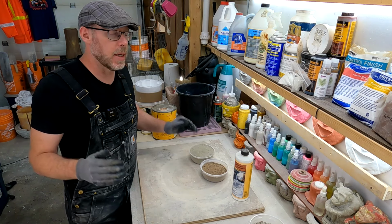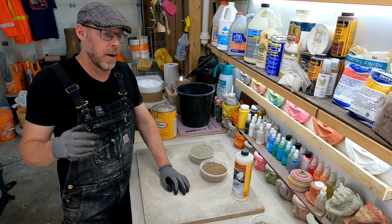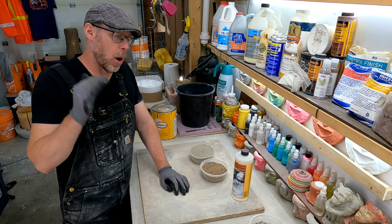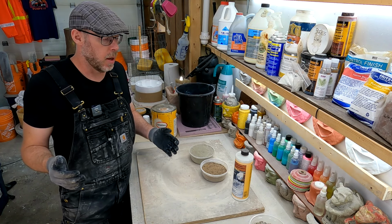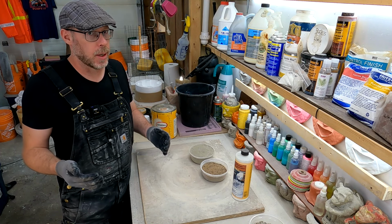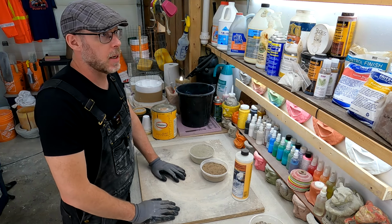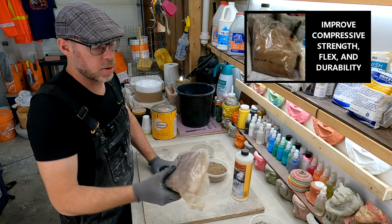And if you did nothing else, just exactly as I've described here, you're probably going to experience a feather edge, and it probably won't fail, or at least will have some measure of longevity to it, which is pretty good again for a feathered edge finish. If there was one more thing, another step that we could take that could get us closer to there, what would it be? And it would be a water reducer or super plasticizer product.